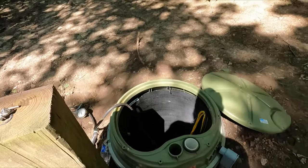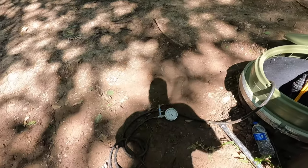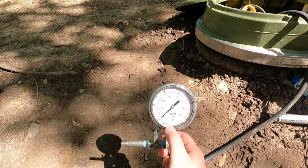We've run it for probably 20 to 30 minutes with the hose down from the house and it's been flowing just fine. They put a different J-pipe down there where it goes into that white tube — that's where it comes out of the pump and into our inch and a quarter tubing that runs down the driveway. The guy from the pump company had a pressure gauge on that J-pipe, and it was shooting up to 120 to 130 psi before the pump was turning itself off from thermal cycling. Now with this all set up, it's barely even showing any pressure on that gauge because we don't have that airlock and we have all this elevation helping to push the water down. He's up there connecting the sewer line to our house right now — by end of day we should have this up and running.